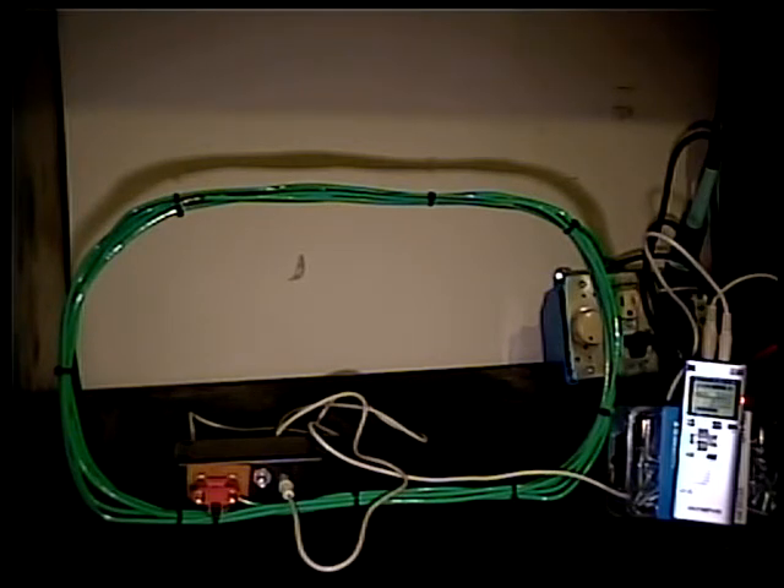This one uses a modified Radio Shack 273-1380 transformer. I first disassembled it and cut all the primary and secondary windings off. Then I wound about 20 turns of number 26 magnet wire on the inside toward the core, and then I used an old 48-volt relay coil with probably 40-gauge wire, or maybe even a Japanese size smaller than 40-gauge.